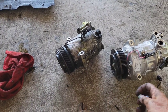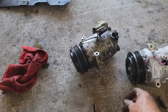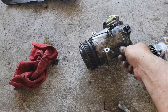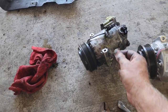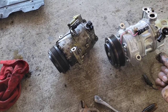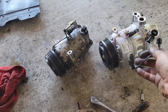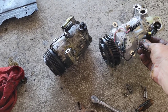It's a little hard to film getting the bolts loose, but it's pretty self-explanatory. I used an electric ratchet — a really good thing to have for this job. A couple of things you need to convert over from the old compressor: transfer all your brackets. This new one didn't have this bracket, so I need to put it on. It's a little different and doesn't have the same casting, so I can't use that part, but I do need to use this extension.